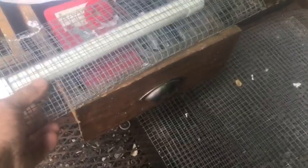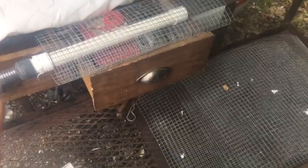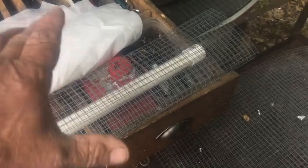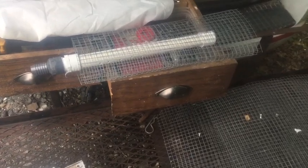The holes are set sideways this time and the pipe fits inside this wire cage to sit at the bottom of the spring. We'll take this filter fabric and wrap around it so any dirt or sediment has to go through a couple layers of filter fabric before getting in. As we build up above it we'll put gravel, filter fabric, rock, and sand - keeping building it up so it'll actually act like a regular earth filter.